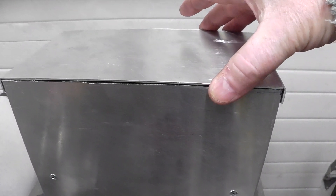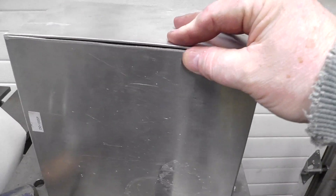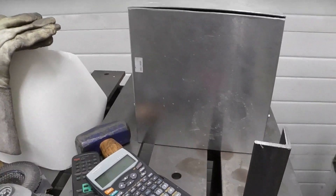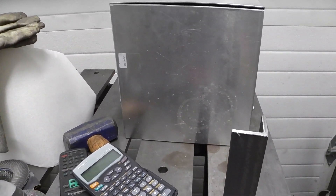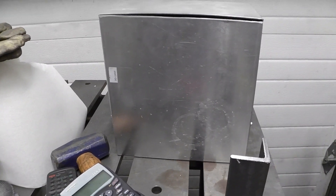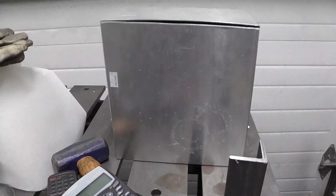This was a bigger box and I chopped it down to size — I have to do a little bit of tacking on the corner. The reason I'm putting it in a box is because when you're doing AC, the frequency makes everything go haywire — it even makes the radio in my shop go all catty-wonka. The AC frequency is high so I don't want it interfering with the power supply. I'm putting it in an aluminum box and knocking out a little knockout for the fan.